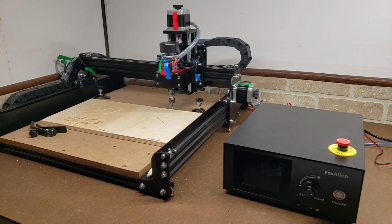I was able to get every axis honed in, I think, perfectly well. Only two of them needed some tweaking. The third one was perfect right out of the box. Originally, when I was looking forward to this machine, I thought all the plates on it were going to be aluminum, but they're actually all steel. They're powder coated black steel, drilled and tapped. That makes it a much stronger and more forgiving machine.